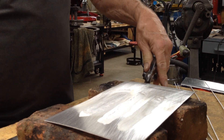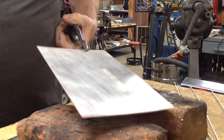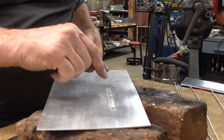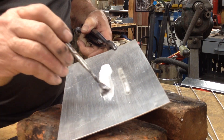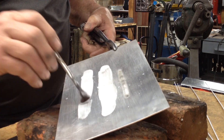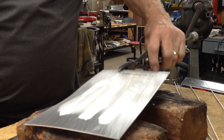Let's see what we can see on the back. You can see it's 100% penetration, but I didn't put any flux on the back, so it's contaminated by the atmosphere. So let's put some flux on the back side. Ordinarily when you're joining two pieces of metal you have a gap and the flux can travel through the gap, but in this case we don't have that.